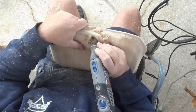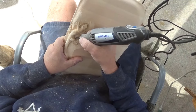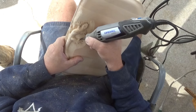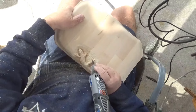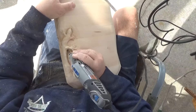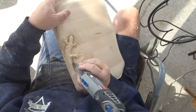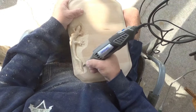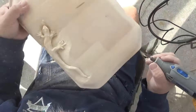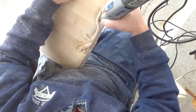You can do this and then take the whole top of the block down with a router and leave him sticking out proud, making him look like he's just sitting right on the top of a piece of wood. I didn't have a router and I didn't want to use up all my wood, so I dug him out and then used a finer sanding bit to smooth out all the wood around it. Still looks like he's just sitting there on top but you don't use up all your wood.